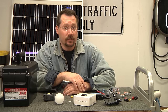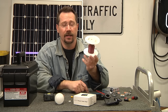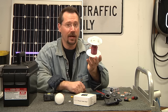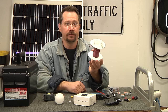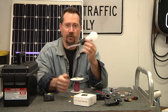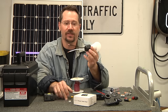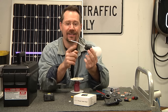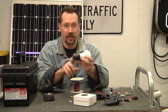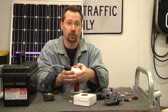For wiring, we'll use 12-gauge stranded wire for up to 20 amps — red for positive and black for negative, which is the DC convention. Keep in mind that for AC circuitry, black is the hot and white is the neutral, so if we use any AC-style components with DC circuitry, we want to keep those color differences in mind.